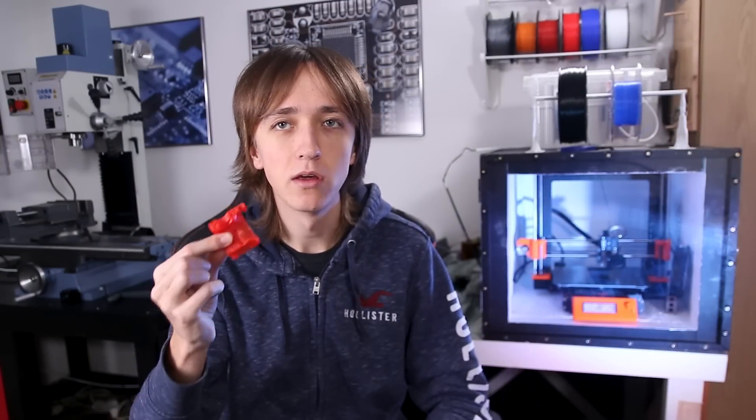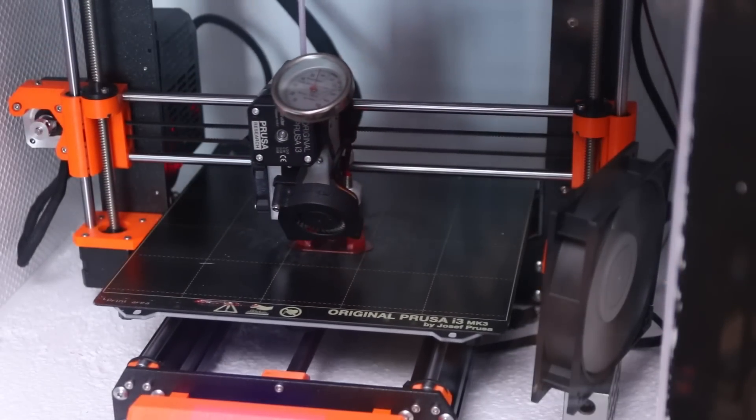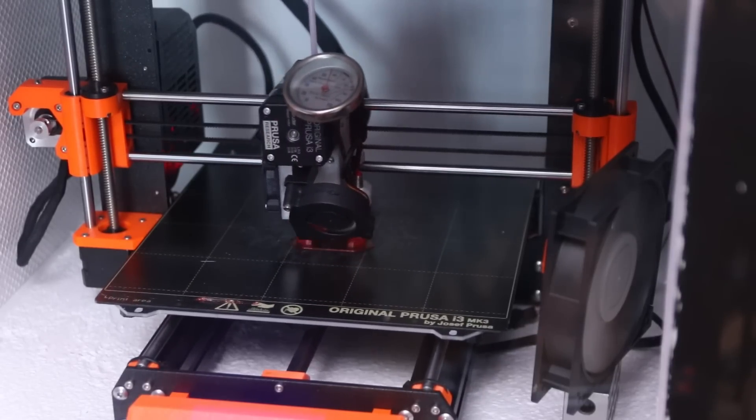Now I'm reprinting them again but this time in polycarbonate, which hopefully should be able to withstand the heat in there a bit better. I also moved my temperature probe, and that's why I usually have a little gap open in the door — because it just works too well. I need the gap to let some hot air out so that the build chamber doesn't get too hot.